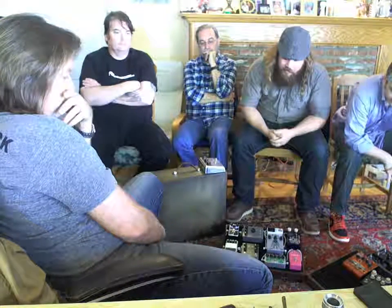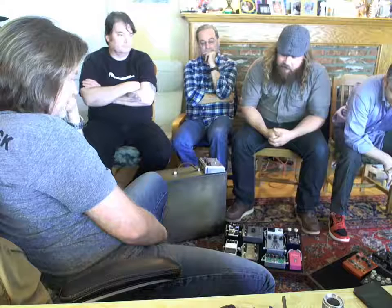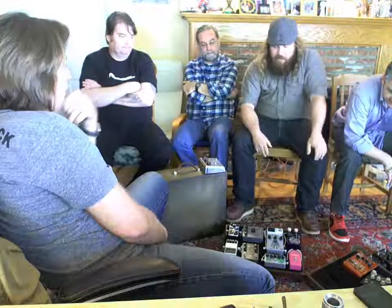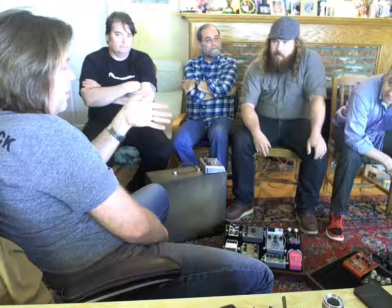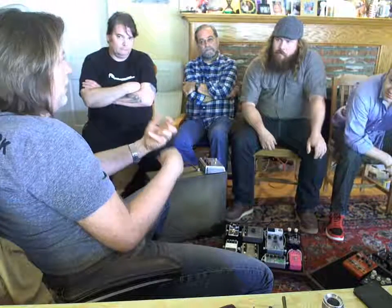So a lot of guys will get real crazy with the buffers and do a buffer in the front and a buffer in the back, and then their delay pedal has a buffer, and they have a buffer built into their volume pedal, and generally that's too many buffers. You pretty much need one thing to push it through, or to balance the impedance, or to get that kind of signal level. Like I played Frank's board a couple weeks ago, and he's got a Boogie buffer on there with a booster switch on it, I think. And with that thing on, even though it was boosted like 5 dB or 3 dB, when he turned it on, it felt like I was plugged into the amp.